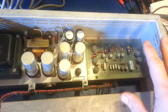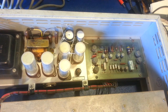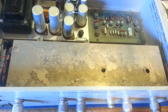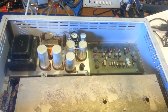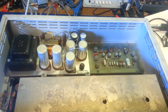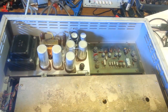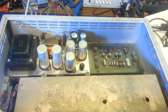There you go - that's just a preview. I'm going to completely restore it. I already did a quick vacuuming because there was so much dirt and dust in here. Here's what both the top and bottom covers look like - lots of vent holes for dust to get in. Look how thick that solid front aluminum plate is. They just don't build stuff like they used to - the whole chassis is solid aluminum. I really need a good cleaning. I haven't even had the RF shield off this section yet, but I do need to recap it. Most of these I can go with modern caps. Looking at the underside, some of these multi-section caps were just paralleled together to increase the value.